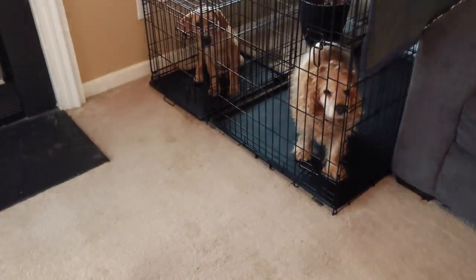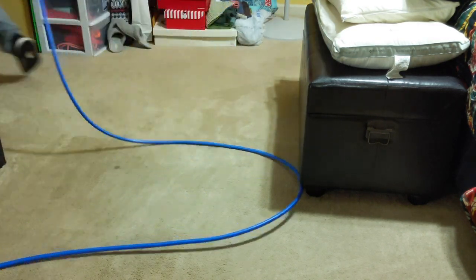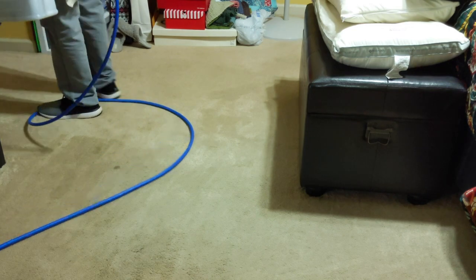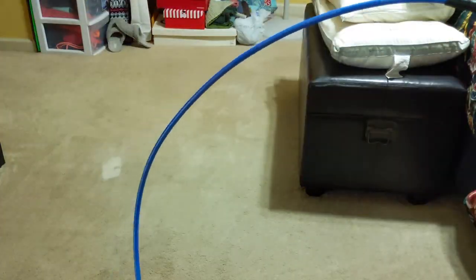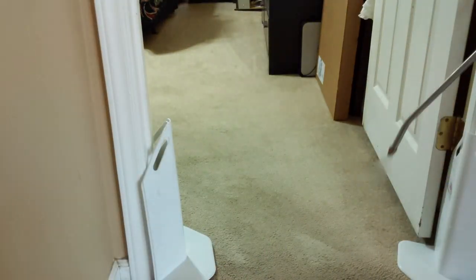This is the treatment we're spraying down. It's set on there for approximately 45 minutes to an hour — at least in the living room it was down for an hour, the bedroom was down for probably 45 minutes. This is our Hydro Force that we're using to spray down the pre-spray, which has a special brew we mixed up just for this carpet with the pet stains and the pet odor.